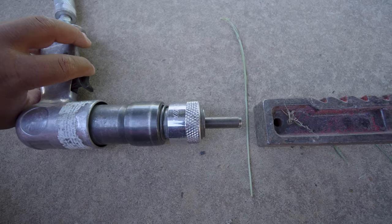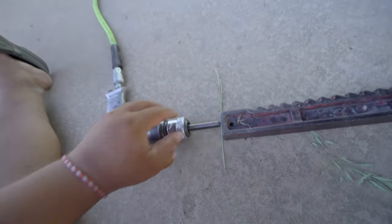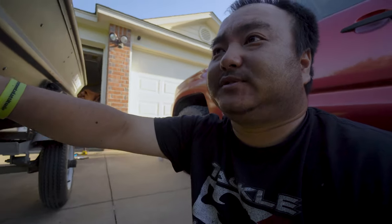I can't show you exactly how it works live, but basically — imagine this green piece is your aluminum and a rivet goes across. I basically do this with the air hammer on one side and backing on the other. That's basically what I did. I'm pretty confident it's not gonna leak anymore. Before, I had a couple rivets where I could hold them and they would almost shake or twist by themselves — that's pretty bad.